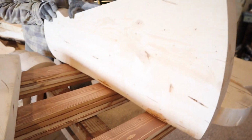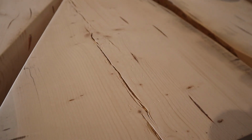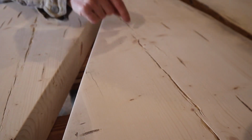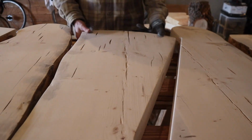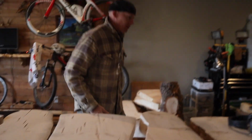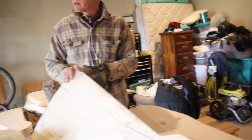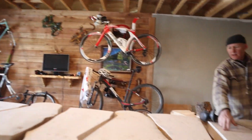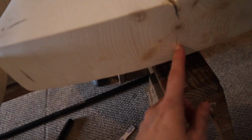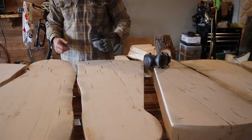So we're finding that some of the stairs have some cracking, because this is the part you're going to be stepping on right here. Right. I think maybe a couple across might strengthen it. A bow tie. One of them seemed to go pretty far through. That was probably the worst one to have. Yeah, this one too, because there's a little bit of a crack down here. So if I put like two in there, I strengthen it up.